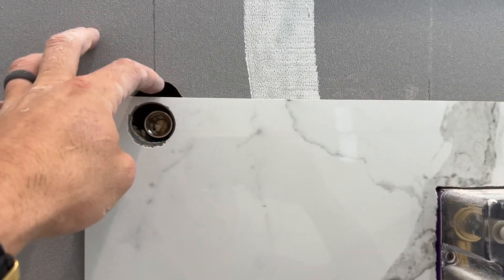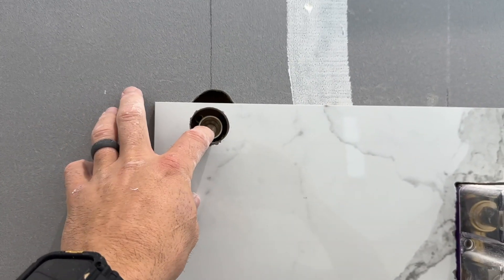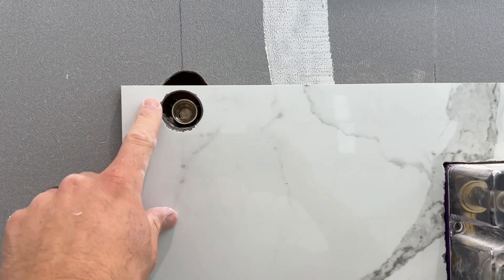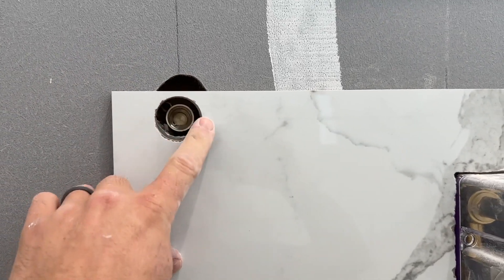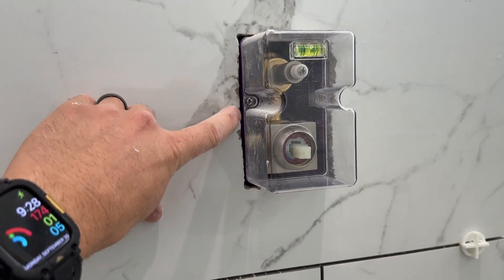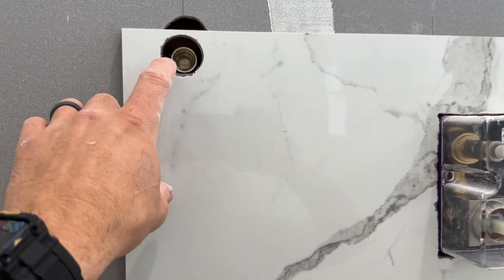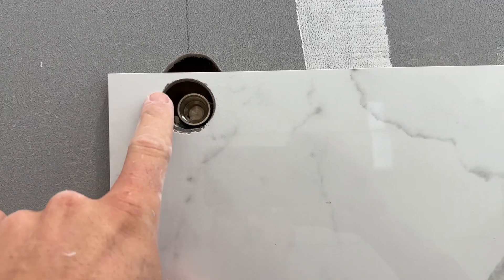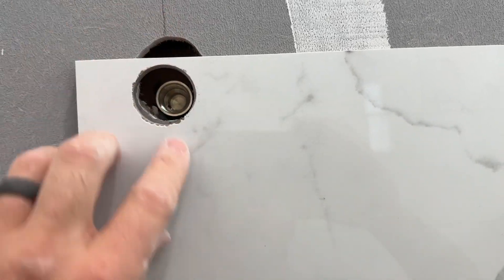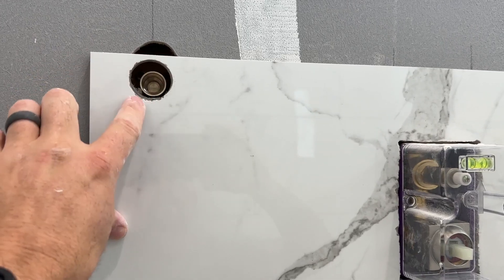I did not install this backer board — it was done by another outside contractor — so I had to widen that hole a little bit, but you can see we are perfectly lined up. To prevent this extra cutout, before putting the board on I would again put the laser level centered on my fitting, put my board up, mark where it's at, remove the exact amount, and then I'd have a perfect reveal. So this won't be a problem — it's really nice that we got that lined up, we're not going to waste any tile. Use the proper blade so you don't get chip-out. I only got this small chip because I took it off and put the bit back in and it caught the edge. If I'd done this in one continual press I would have gotten a pretty clean cut, and there's almost no blowout on the back. That's one way to do it — I just wanted to show you guys how to get your holes drilled perfectly the first time on your tile. If you have any questions, let me know in the comments below.